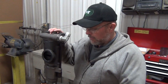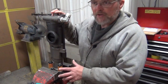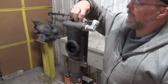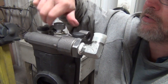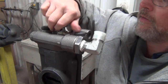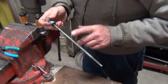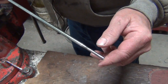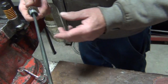The first thing we want to do is take the drill, stand it in a vise — whatever you're comfortable with — just make sure it's good and sturdy so it doesn't drop on you. We'll take the air tube out of the end of the drill for starters, inspect that, make sure your tube is in place, make sure it's not worn off on the end, and that it's in good working order.